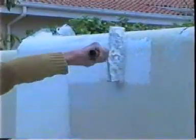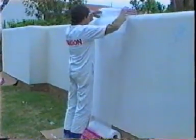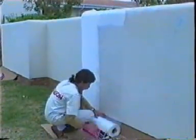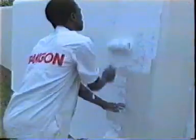As the paint dries, the Crakgon fiber pattern becomes clearly visible. At this stage, apply succeeding drops to completely cover the area with Crakgon. To ensure perfect joints, leave a 50mm wide vertical stripe of dry, unpainted Crakgon down the open edge of the material against which to butt the next drop. Tack the edges together to hold the new drop in place prior to painting fully.